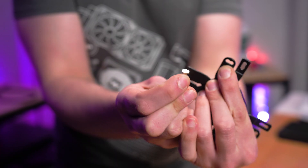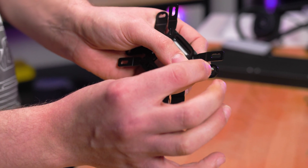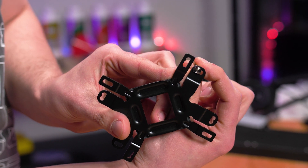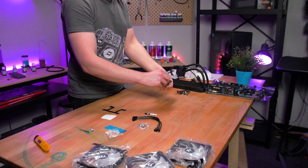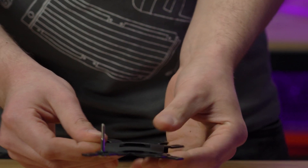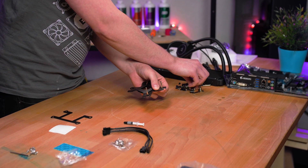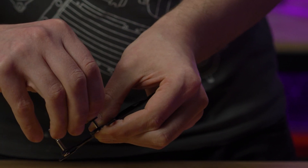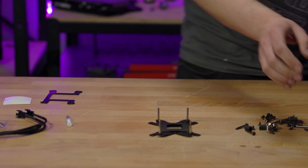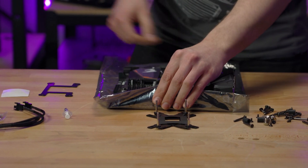Now it's time to grab the four long backplate screws. Mount these screws in the specific mounting pattern and location, which is determined by the chipset you're using — you can find this out by checking the FlowRC manual. The screws have a flat side and a round side to their head, which ensures they stay in place and means you can't really install them wrong. Also ensure to place a washer on the inside of the backplate, as this helps to lock the screw tightly and balances out the offset of the backplate. Now go ahead and install the other screws.